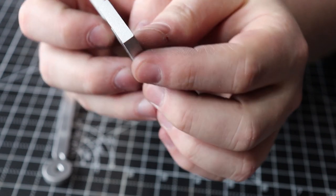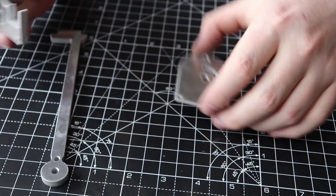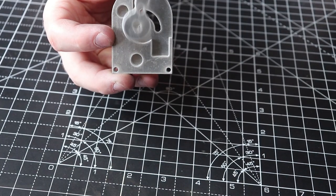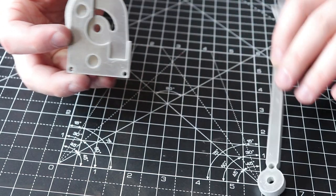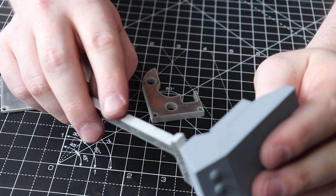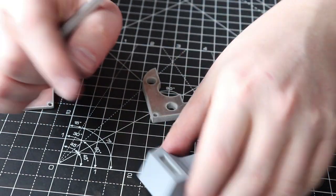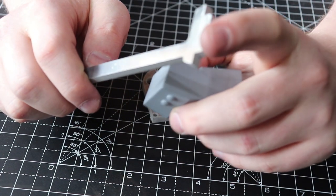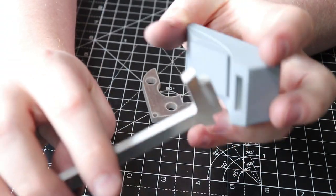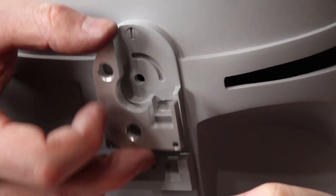My metal pieces have arrived — the turnaround was actually very quick, just a couple of days to get these cut and shipped to me. They're really well cut out. With water jet cutting you do get some rough edges which can just be sanded down with not a lot of effort. The 2mm base plate goes on first, then the 6mm stalk sits on top, and the rangefinder sits in there. Unfortunately the top doesn't quite fit into the rangefinder yet — the aluminium is a little bit too thick.